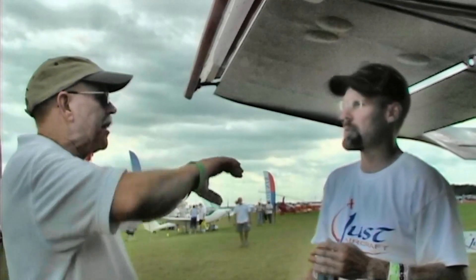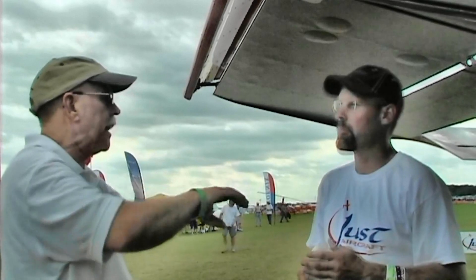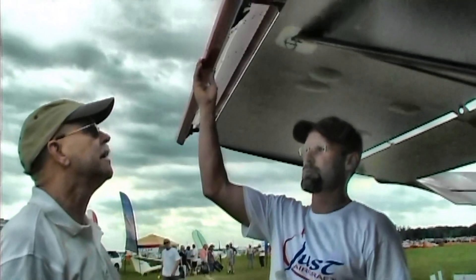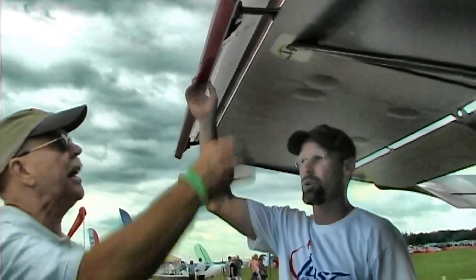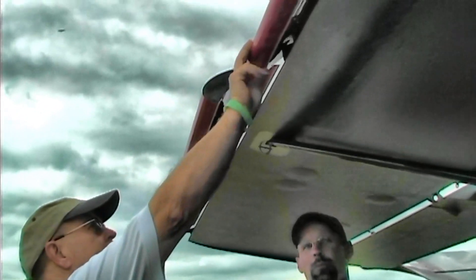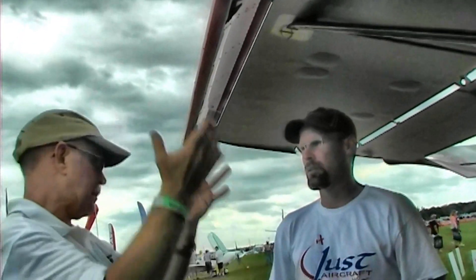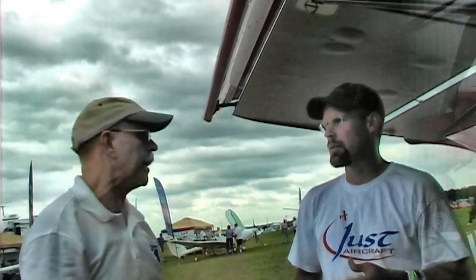These can't bind up in the center even when the wing is getting some high loading on it. They're all on sealed bearings — you can't tell that in the video of course, but that motion is very fluid and smooth; there's no jitter as it moves. That's why I'm using bearings to make that happen. We looked at the leading edge, but the trailing edge has had some treatment here too.